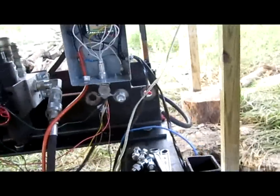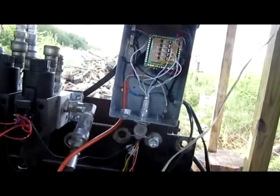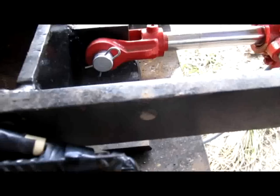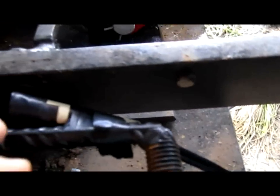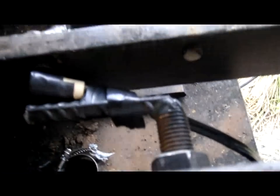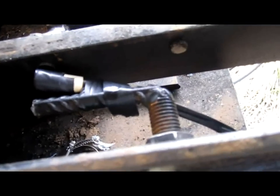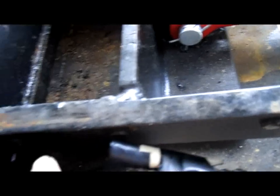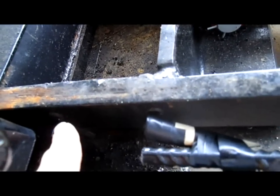Let's talk about the connections. First, as far as how do you know the magnet orientation — these magnets do have an orientation so that the sensor could differentiate between plus and minus, where the outer ones are plus, the middle one is minus, and the other outer one is also plus.